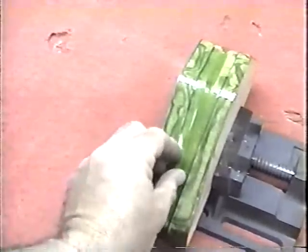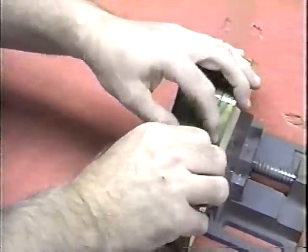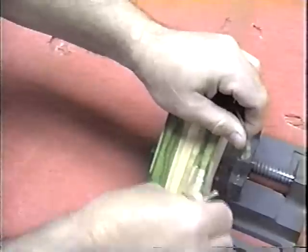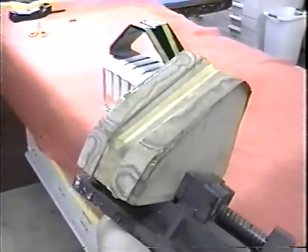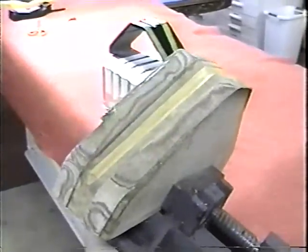You see on this mold where the PVA is already tearing away. And so the trick here is to clean the whole mess off the mold, re-clean the mold, re-wax it, fix any little imperfections. This is the one we did with Brodak Dope. That's holding up very well. Still nice and smooth. Now I wiped this all down with M600. I'm going to take it out and get another coat of finishing material on there.